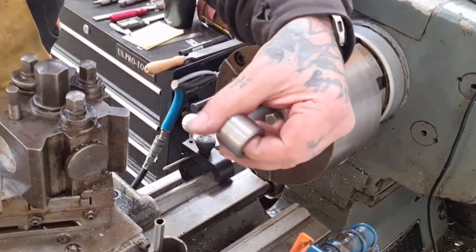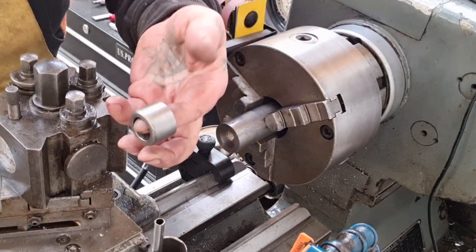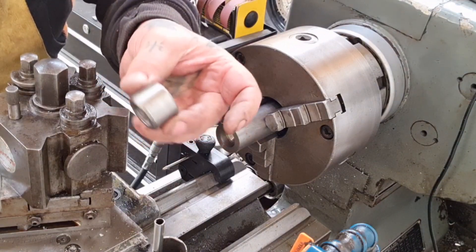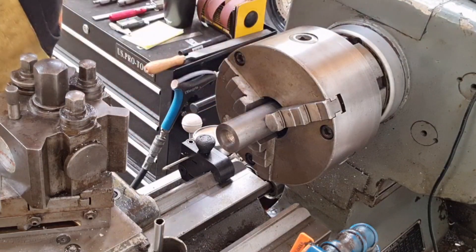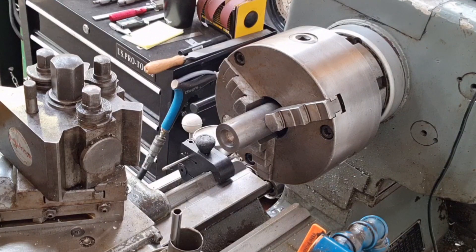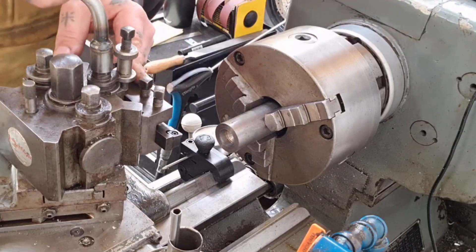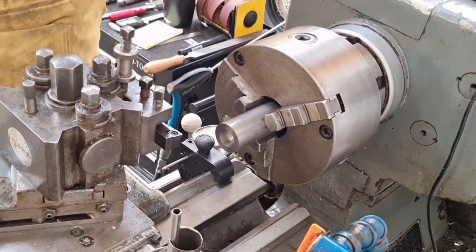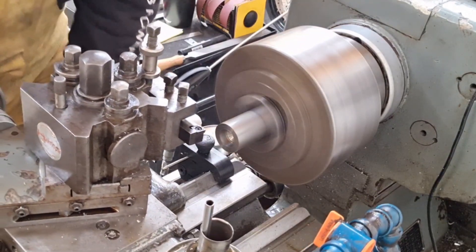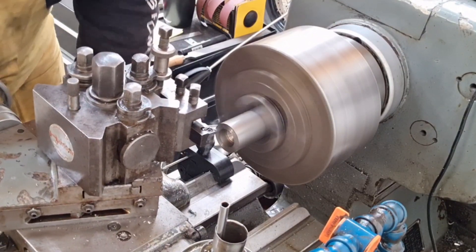This is one of the wheel spindle spacers out of the sports stuff that I've just done. I'm just checking alignment and fine tuning it - I need to make one a little bit longer, about 4 mil longer, just to satisfy me. It'll be alright with that I guess, but you know. I'm just going to face this off and bore it out to 19 mil. I've got three quarters and the job should be a good one. So it took me too far out.